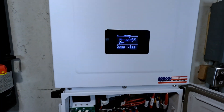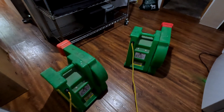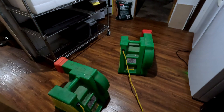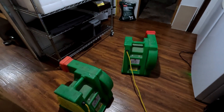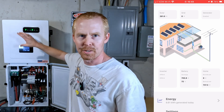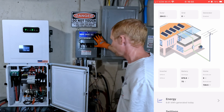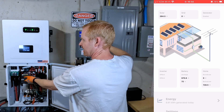I'm going to leave the rest of the house running like normal. Right now it's 213 watts on leg one and 381 on leg two. I put both blowers over here — these are both two-horse blowers — so it's going to put quite a bit of load on leg two. Leg two right now is not significantly high, but the surge requirements for these motors are going to be pretty big. Right now we're powering 731 watts of total power. Let's find out if it can do it.